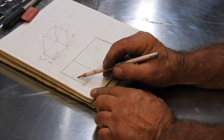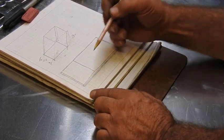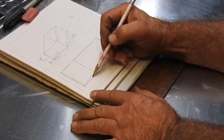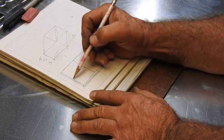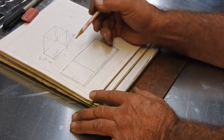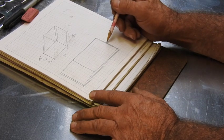So let's draw down here the small section, the wider section, and then add the dimensions you know you're going to need: two half-inch marks for a double hem flange, a one-inch allowance on one end for a Pittsburgh — typically on the smaller of the two dimensions — and then a quarter inch on the opposing end.